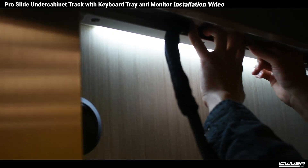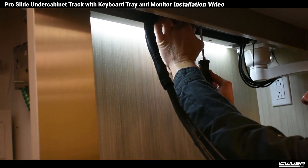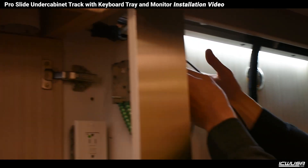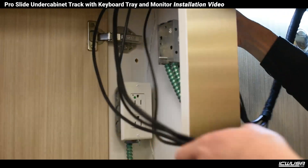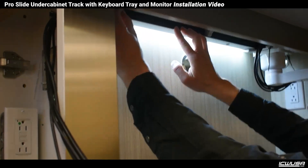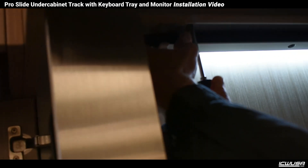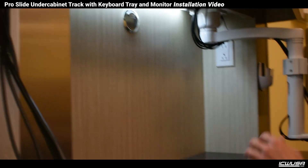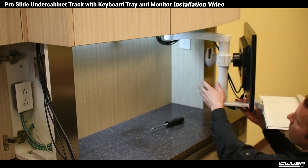We've got a little cable clamp here that we just put hand pressure against — we're trying to pinch not just the loom but the cables on the inside. Single Phillips screwdriver there. We're going to pass the ends of the cables through the bulkhead of the cabinet. Second clamp on the inside of the track here, and pressure. And that's pretty much the installation — now our cables run with our trolley.